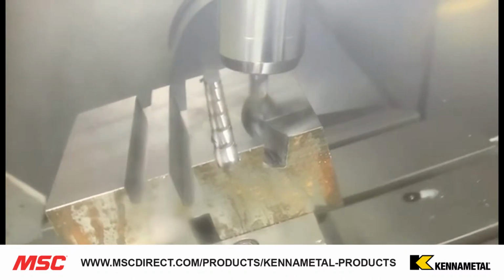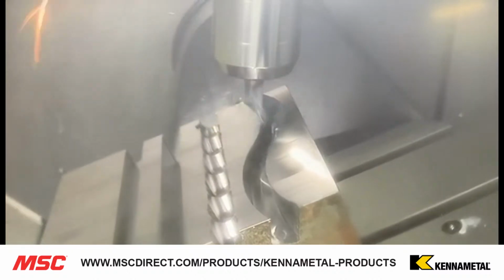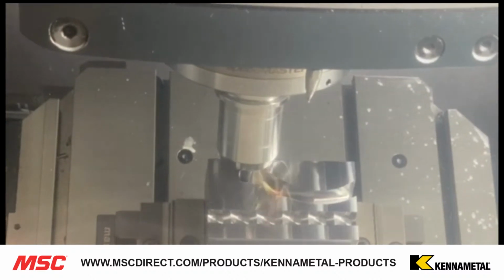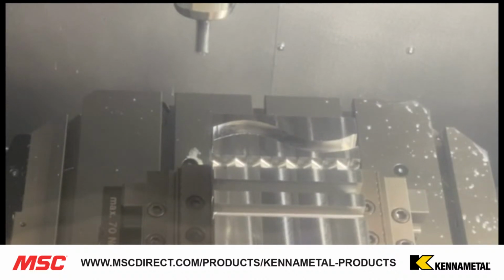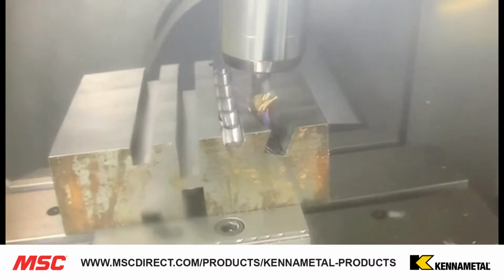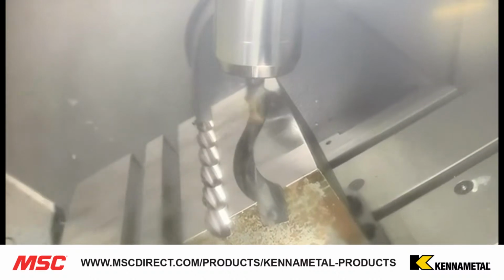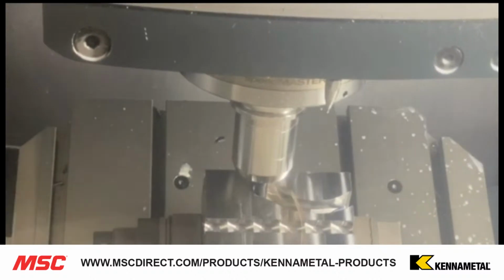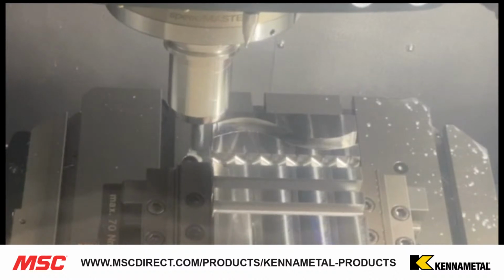Yeah, this is a full 5-axis turn. You can see it for yourself. It's not only S-curving through that part, it is Z-axis milling up and down, ramping as well. And I don't know if you'll ever find a tool to go that deep, that aggressive. This is 550 surface footage at 2 per tooth, and I believe that's twice the diameter in depth. That's a full 1-inch depth. And show me another tool that'll do that.